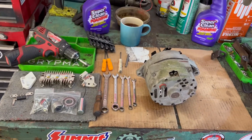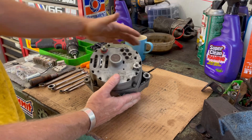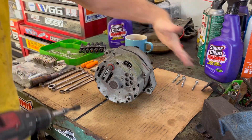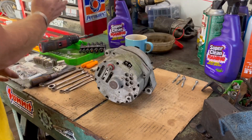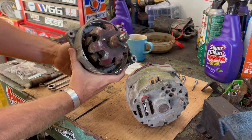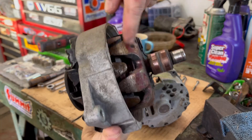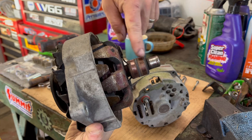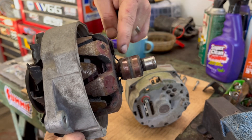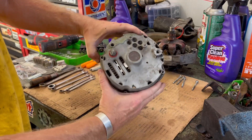Let's see if we can get this thing working. First thing you need to do — from what I can remember, having done this all of maybe once or twice, I'm a real pro — is we'll split this case. Just like when you're taking a carburetor apart, try to set stuff in order off to the side. So here we've got our rotor — because it rotates, you don't say — which is a lot of wires and a magnet. That makes a magnet. This is where you've got two brushes that ride on these two collars right here. They look like they're one piece but they are separated — I think that's carbon or some sort of fiber in between. Either way, this is not the problem, so we're just going to leave this half alone.